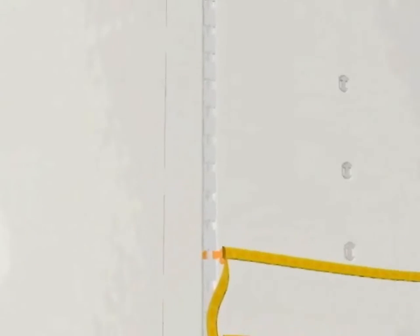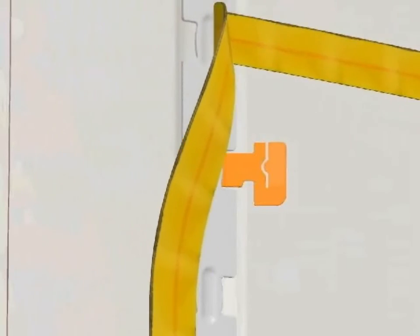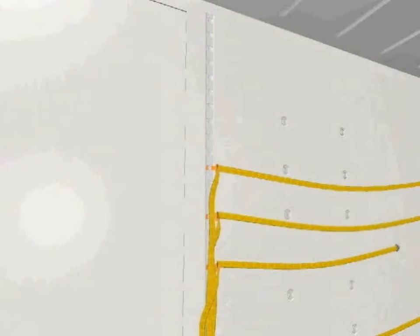To maintain the correct height of the webbing and to keep it out of the way during loading of the car, install the webbing supports into the doorpost anchor at approximately the same height as the lading tie anchors to which the hooks are attached, and insert the webbing into the slot in the webbing support. Allow the balance of the webbing to hang freely.